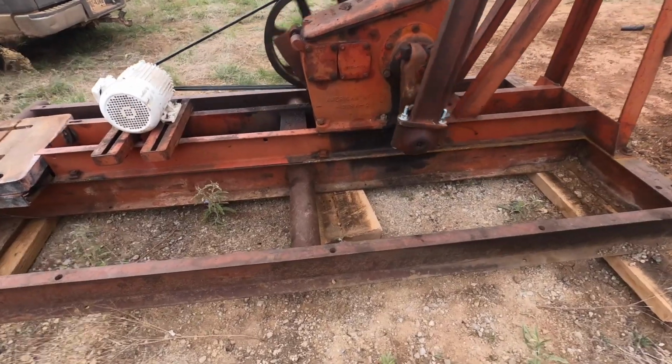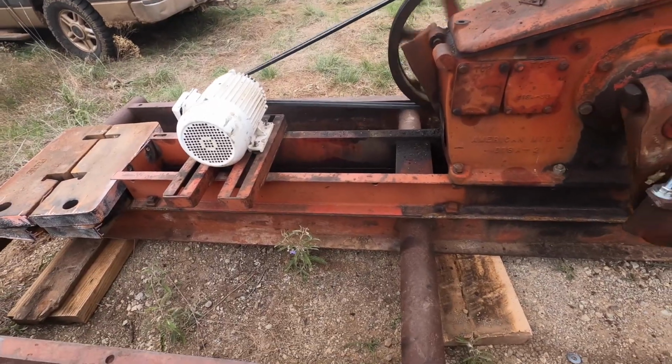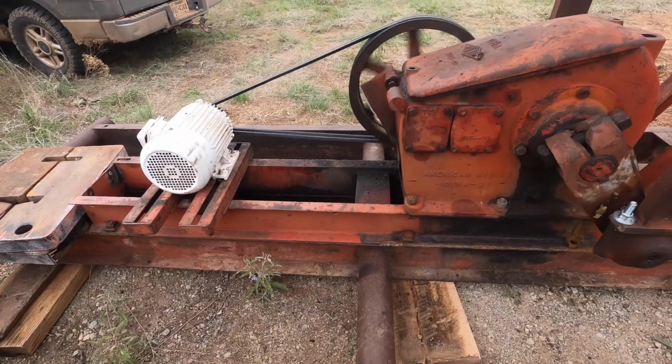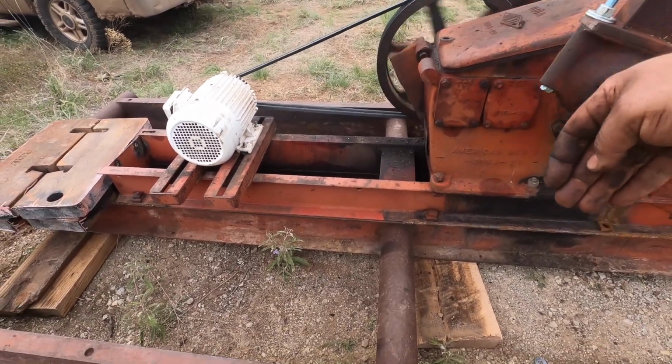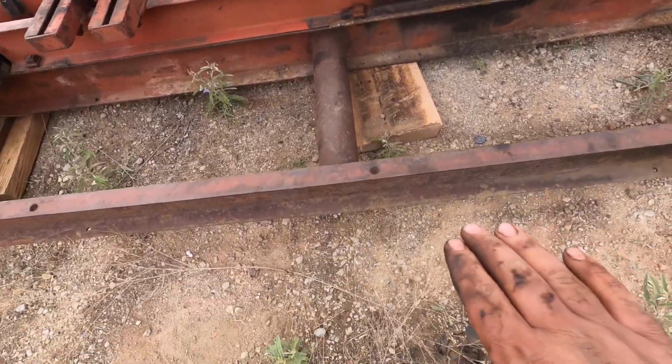Now, the next thing, the reason these boards don't come out past the edge here is always what happens. Your weight's in the middle, and these boards will settle, all this will sink, and you'll end up with a board pushing up on the outside of the skid.